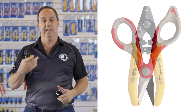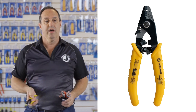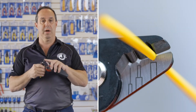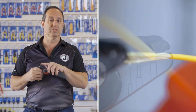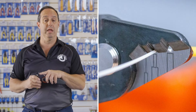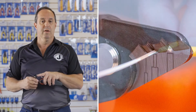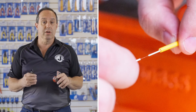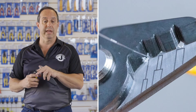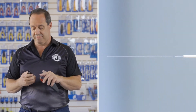Second is our very popular JIC-375 three-hole fiber stripper. It's designed to strip jackets from 1.6 to 3 millimeters. The center hole is designed to strip the buffer coating from fiber from 600 to 900 microns in diameter. And the third hole will strip your acrylate coating, getting you down to your 125 micron fiber.